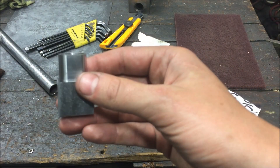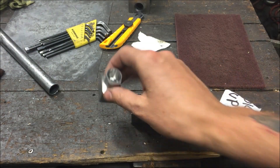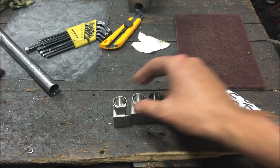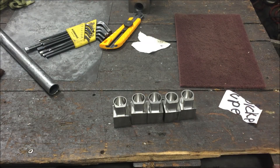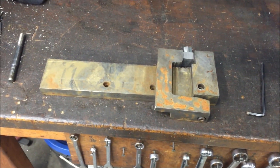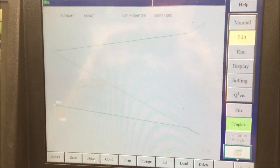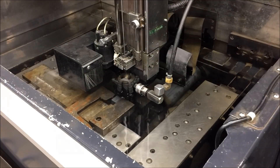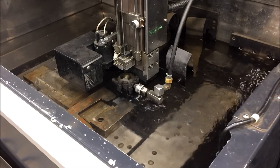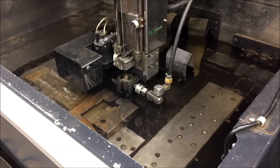We've run a few here. I actually ran them in two different sizes — you can see how much excess material is left on there. That's the women's size there and this larger size is for the men. Next, we're going to take these and put them in a simple vise — I'm going to pick up every single one so I'm not too concerned about repeatability. This is going to go inside the Sodick AQ325L wire machine. There's the program — you can see it's going to cut at two angles. The wire breaks at some point here and goes back; it goes pretty quickly, about 10 minutes of cutting per part.